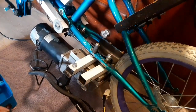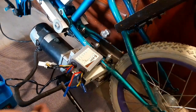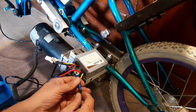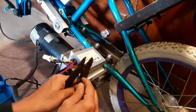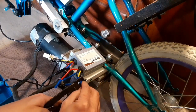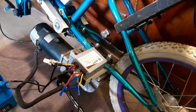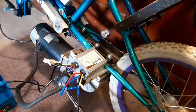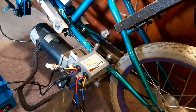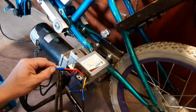Let's hook these up — double check again, yes that's the negative wire. You only get one shot with these power supplies. If you hook them up backwards on the battery side, it will blow up the box almost instantly, or if you're lucky it'll just blow the fuse. Hook the positive up now. The wiring I'm using is the same gauge wire, but the leads I have just have a lot more insulation on them.